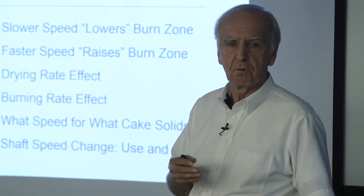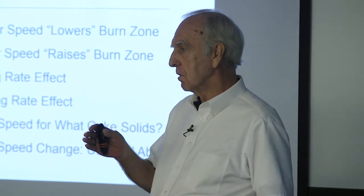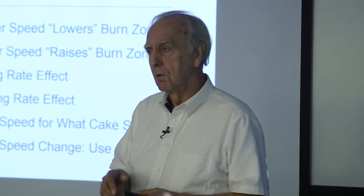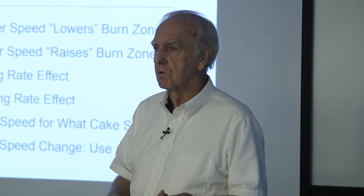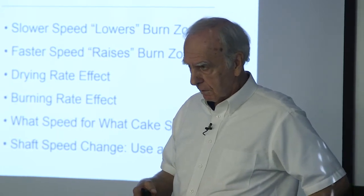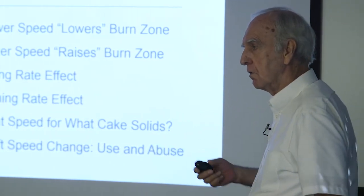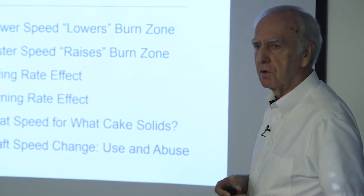We reference around one RPM, because if you went around the country that's where most of the furnaces are running — one RPM plus or minus depending on feed rate and cake quality. So a little bit over one RPM for a higher feed rate and wetter sludge, and a little bit less than one RPM for drier conditions of the day. The furnace will train you — you get the feel for what fits for your cake solids and feed rate of the day, because it keeps reporting back to you whether you've found the right shaft speed range.